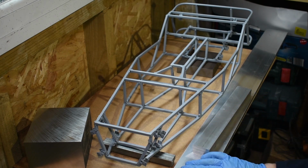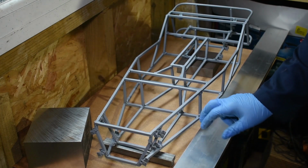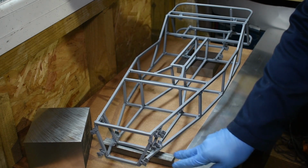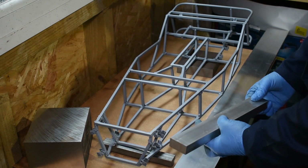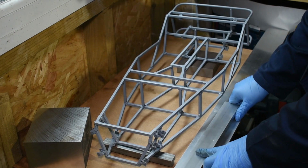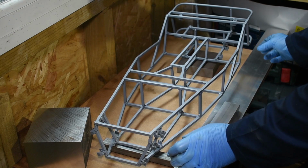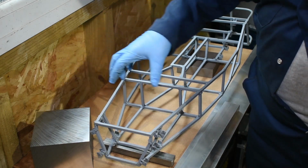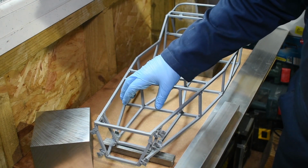So in the next video I've already got my materials ready for the suspension brackets. I've got some 80mm flat bar aluminium, which will be the suspension wishbones. So that's what we'll be making in the next video. I've also got a slightly thicker 40x20 aluminium bar, and I'll be using them to make the uprights on the front and the back that'll carry the wheels. But I've also bought a lump of 7000 series aluminium, which is what's going to form the engine block. So in the coming videos we'll be making that as well.